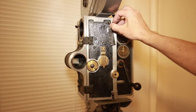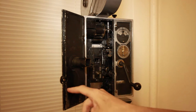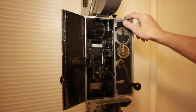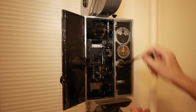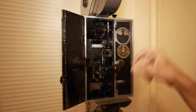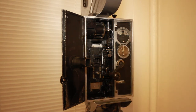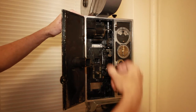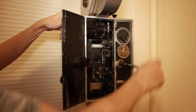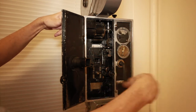Here's the back of the camera again. You can see this viewing tube right here, and this velvet film guide to not scratch the emulsion. Here's the pin for your focus. It's a great mechanism. One of the great things about this is it's so smooth, and most cameras that have an auto-dissolve have some drag when you engage the mechanism — this has none. It's fascinating. You're cranking, you push this button, and this great clockwork mechanism starts to move your indicator dial. I'll show you a dissolve through the lens before this is over.